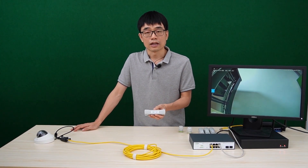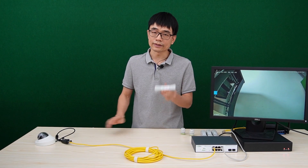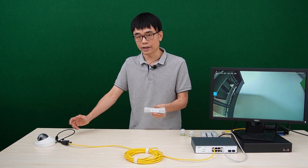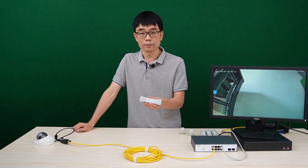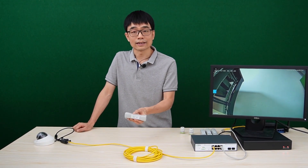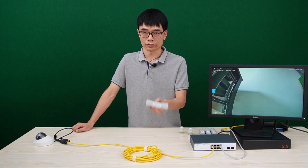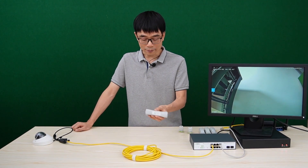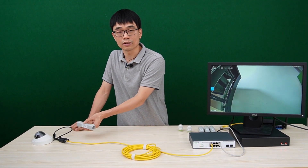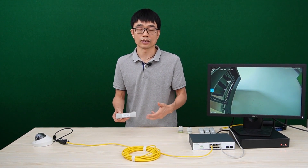There are two kinds of scenarios. If the distance is less than 600 feet, we only need a single PoE extender. It will repeat the PoE network for the IP camera. You need to place the PoE extender in the middle of the cable, just under 328 feet before the signal starts dropping. You cannot place the extender at the very beginning or right at the camera end — it will not work because TCP/IP network is limited to 328 feet per segment.